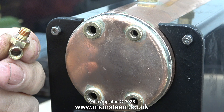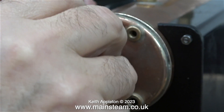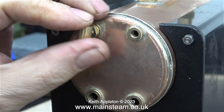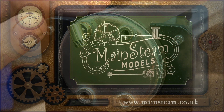It's really important that the water gauge fittings align with each other. This is the top water gauge fitting — I've applied some Loctite 542 to it and here I'm screwing it into position. In this clip I'm fitting it using hand pressure alone. I fitted a shim washer to make sure it ends up in the right position, but for that to happen I will have to use a spanner, and that is in the next episode.